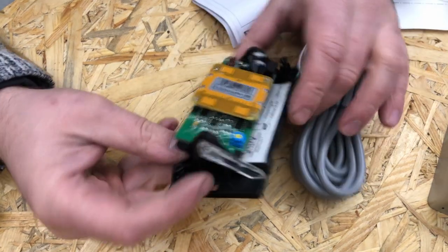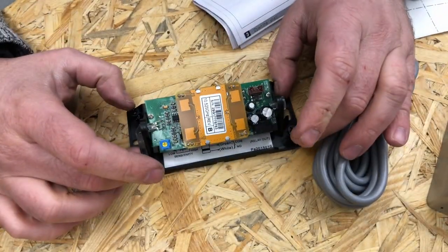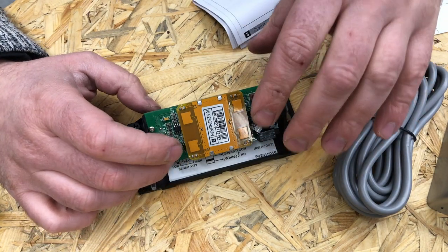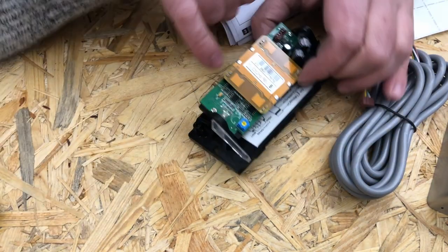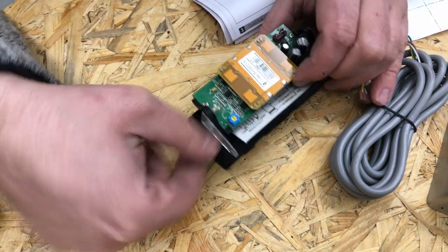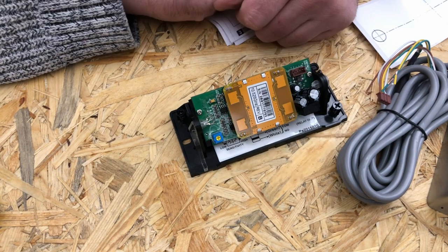And this is a nice thing, because this, I think, can be tilted. You will mount this on the wall or on the enclosure, and you have to turn this up and down to change where the sensor should look for the movement. And they have an LED here with a light channel, light guide. Since this has to be movable, they just mounted this inside of the light guide, so it sort of pivots around the center of the LED.